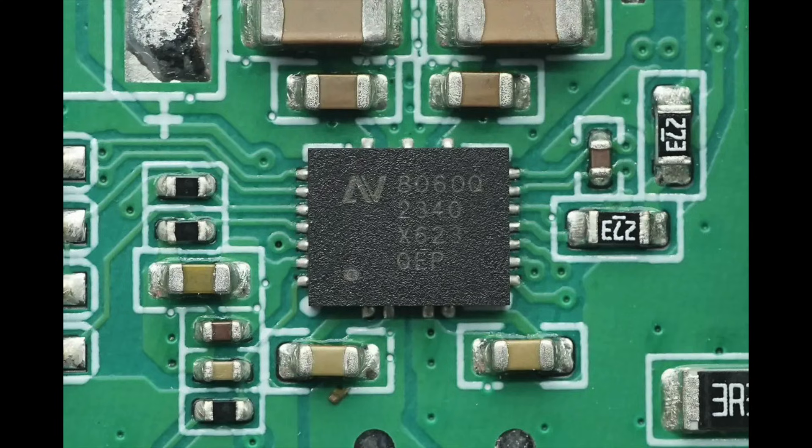The wireless charging power stage chip is from NuVolta, model NU8060QH. It is a highly integrated, high-efficiency, and high-precision wireless charging transmitter chip that meets AEC-Q100 grade 1 standards. The chip supports a wide input voltage range, with a recommended maximum operating voltage of 27 volts and a transient voltage tolerance of up to 36 volts. A single chip can support up to 80 watts wireless charging for the RX load, enabling high-power wireless fast charging. The NU8060QH integrates a 12 milliohm low-resistance full-bridge and offers exceptional thermal performance compared to existing products on the market. It also integrates full-bridge drive, 5V LDO, high-precision current sensing, Q-factor detection, and internal communication demodulation functions. The chip comes in a QFN21 package.